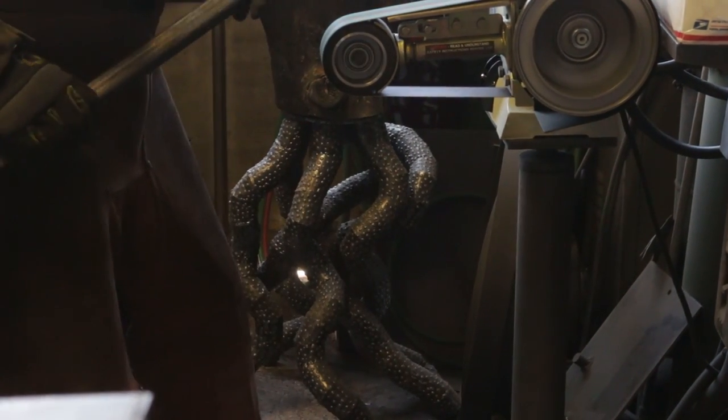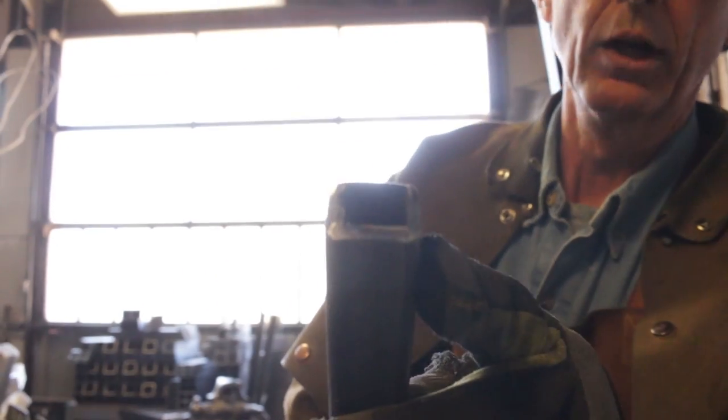So let's spend the next few minutes and get this thing welded out. The first thing we're going to do is chamfer these edges on the 11 gauge square tubing so that we get a good solid weld and we're able to disguise where the foot attaches. That's all we're looking for.